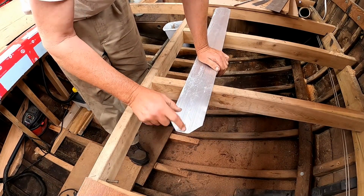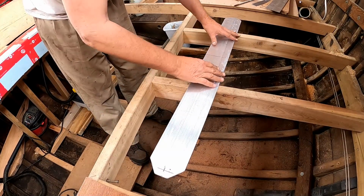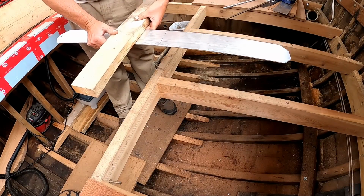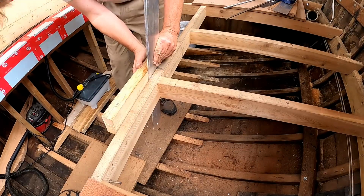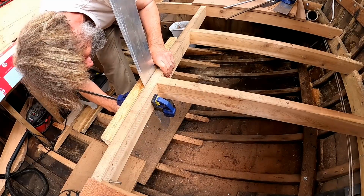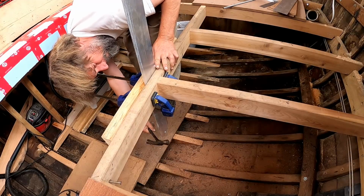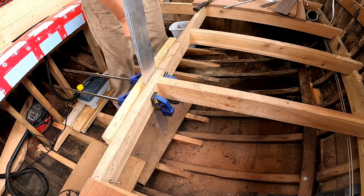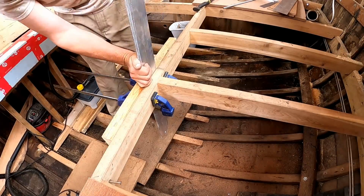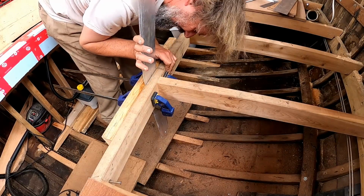Okay then, well a cutoff wheel is definitely not the right tool for cutting aluminum, but it's what I had handy. Alright, let's see about folding this. Okay, so the best I can think of is basically making a homebrew brake here like this. Get the clamp going on here. Alright. I'll start just with pressure and see how that goes. 3/16 aluminum is tougher than you might think.